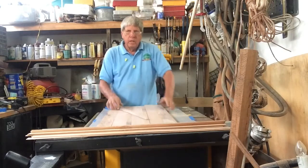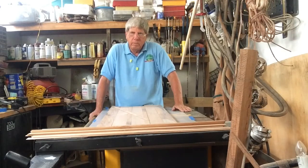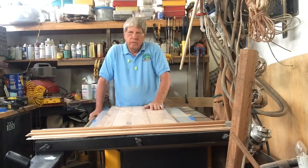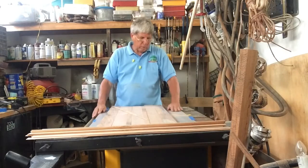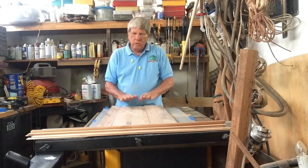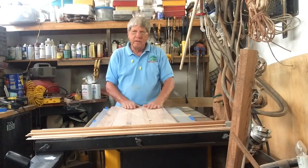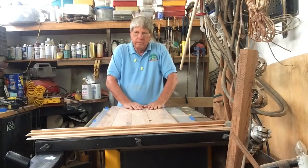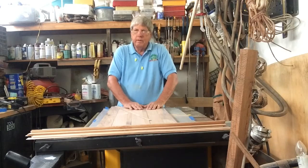And we're going to stick this up. I don't have a big flat surface, but I do have a nice tabletop that's absolutely flat, which is the top of my table saw. So this is in fact the surface that I stick everything on. In sticking this, I put greaseproof paper on the bottom of it, so whatever glue gets on it, it's very easy to take off. And the top surface is turned upside down, so that if there's any imperfections, I can just put my hands and feel there's slight imperfections here. The surface at the bottom is going to be flat. So that's what we're going to do. We're going to stick the base, and it's time to get going.